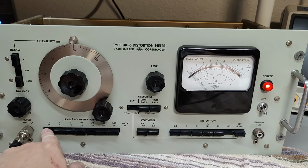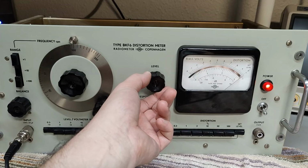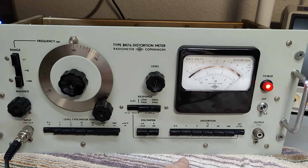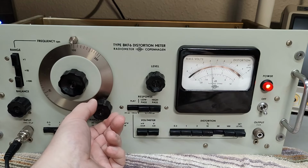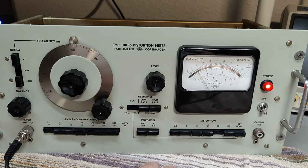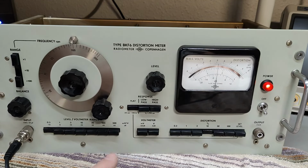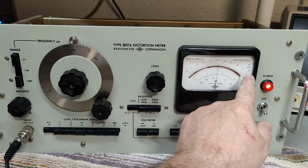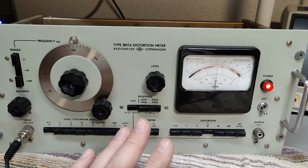All right, we are here and I've adjusted this for 1 kilohertz and let's go to set level. So here's the thing. Let's adjust the level for the set level indication. And let me crank it to like 30%, whatever, right? See, if I dial the frequency, ooh, it gets bad. And then, ooh, it gets bad. So it's all about finding this super duper good spot. And then you go down. So that's 10%. So 5 is, okay, so it's like here, right? So that is 10, where is 10? Okay, so this is 5% distortion, and my generator here is less than 1.